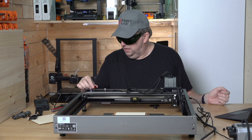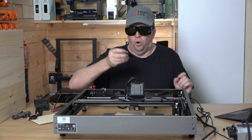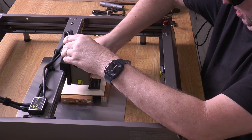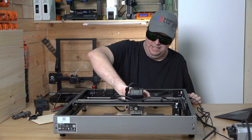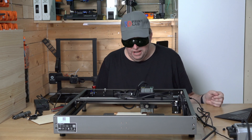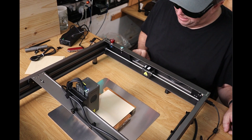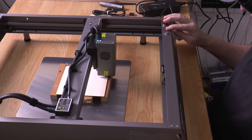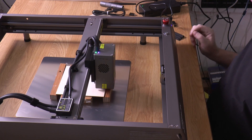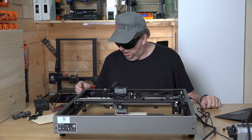I've unset the emergency stop to get things going. Using the little offset gauge — it's a thin piece of wood, so I'm going to go to about a 1–2–3 mm setting. Drop down with the two screws. I've set the height. Let's get our piece of wood and now we are going to frame. I'll hit the frame button — this will home the cutter, set the frame to the beginning of the file, and show us where it's going to cut. Got it pretty spot on. The air is on, I'm ready. Now I'm going to press the play button. Here we go — first time engraving on this machine!